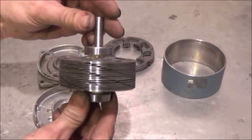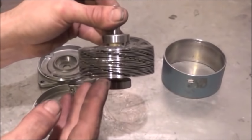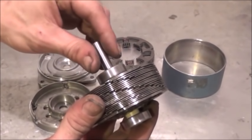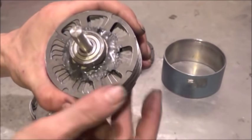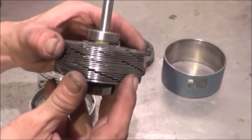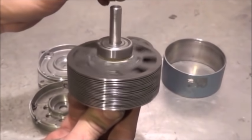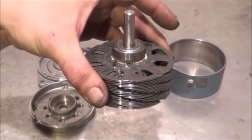Now that I've completed the entire rotor, I just want to go over it with you real quick. You can see the staircasing line going up the outside edge over and over again, all the way around it. That is one of the advancements I'm doing to the Tesla turbine — the outside edge of this was typically very smooth, and you had to get to a very high RPM before it started producing the efficiencies that Tesla had recorded. These are actually just little indents based on that little notch — there's four on each one of those plates, and because each one's slightly staggered off from the next, it makes this nice staircasing look all the way around the outside. Each one of those little edges — the front-facing edge that the air is going to impact — gives a little step to get it going. So we should get a much higher efficiency at lower RPMs, or at lower pressures at least.